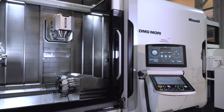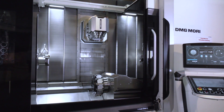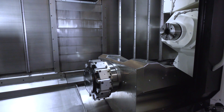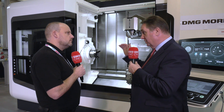This kind of machine is about low volume, high variety — the idea is you get components through the workshop quickly in one hit. So having a big tool magazine is a huge advantage. You might have runners coming through every month where you want to make one or two — just leave the tool set in there. With the Capto system you can also have multi-tools, so there are opportunities to go higher than 76.